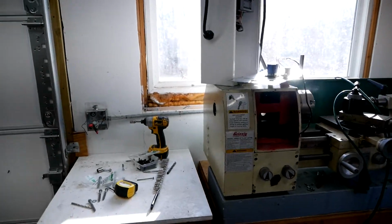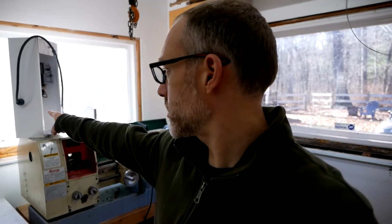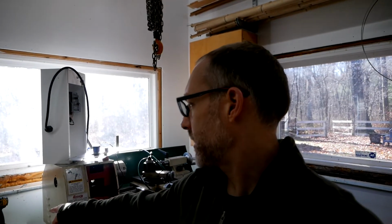And the final straw was when I go to use my lathe. Well, nothing to see right now, but big old mouse nest right in the headstock. So, you know, where the bearings are and the wiring, which was all chewed. So I have to rewire the control panel of the lathe. Shouldn't be too bad because I know where the wires go because they're mostly still there. But I got to cut this, rewire that, maybe finally mount the VFD, which was never really mounted, it was just kind of sitting on this bench top here next to the lathe, and so it would be nice if it was mounted out of the way.